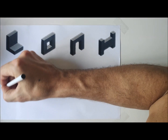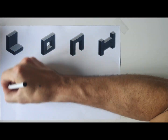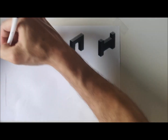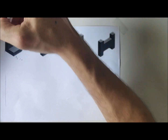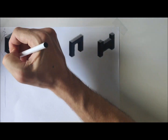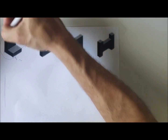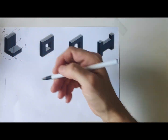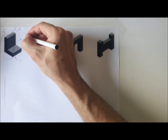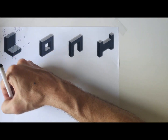Whenever I'm starting an isometric drawing, going back to basics, we look at those three directions — effectively the three axes. We've got our first line, which is our y-axis, and we're also going to look at the z-axis. The reason I'm drawing from this first plane is because this is my profile that I then want to extrude along the x-axis. So I'm going to construct my crate to include this shape, then extrude that profile across on the x-axis. I've drawn my first line — that sets my stage effectively.